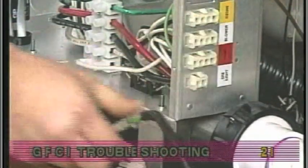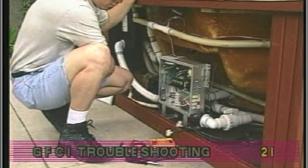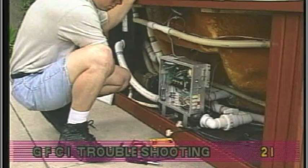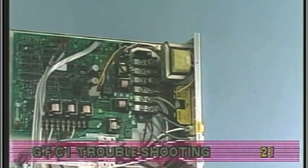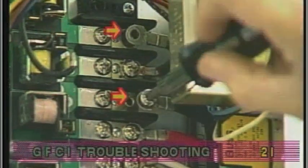Repair or replace the component as instructed by the spa manufacturer. If you have unplugged all the spa's components and the GFCI still does not reset, then the problem is most likely a ground fault in the heater. To disconnect the heater, first turn off the circuit breaker. Then remove both heater straps or wires from the terminal block, not the heater itself.